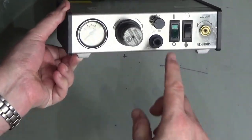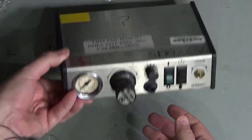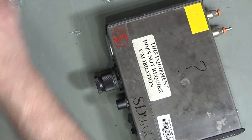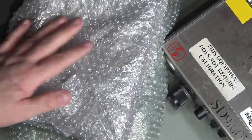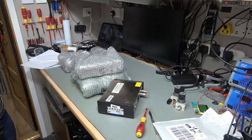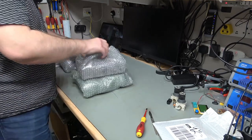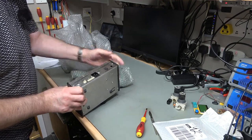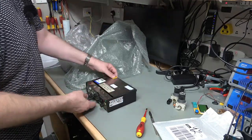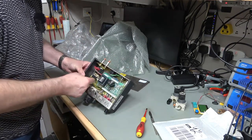Made by Semco, who still make devices like this, along with all the accessories — syringes, paintbrushes, and things like that. If you look at something hand-painted from a factory, there's likely something of this nature providing a constant feed of paint, glue, or similar. So I have four of these in total: one in fairly good state, one very badly cannibalized, one that appears complete and stands a chance of working, and one missing an air intake valve. This last one reportedly has an air leak inside — some potting compound visible — but I'm sure we can trace the air leak without too much trouble.